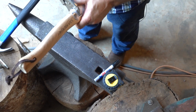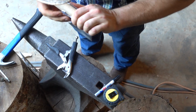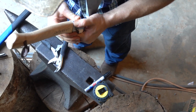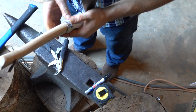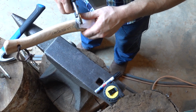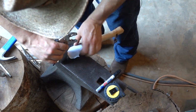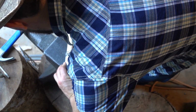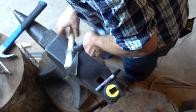Now what I want to do is take my vice grips off and make sure that nothing is loosened up, because a lot of times you can end up getting just a little bit of looseness here. And you can even take up, like I was saying, any slack that you get in there. You can take up at this point. And it's especially, like I said, if you don't mind if your aluminum gets a little bit of scuffing on it, you're really able to take up almost all of that at this time. So let me go ahead, because these vice grips will grip on that aluminum a little bit. I'm going to hold this.